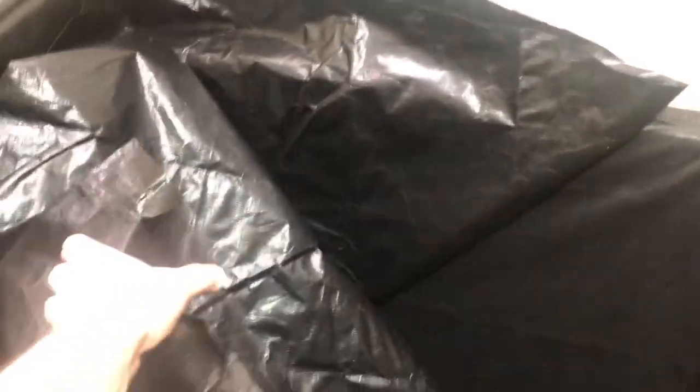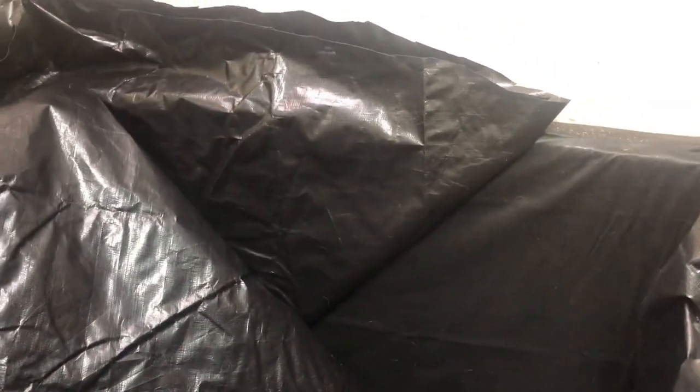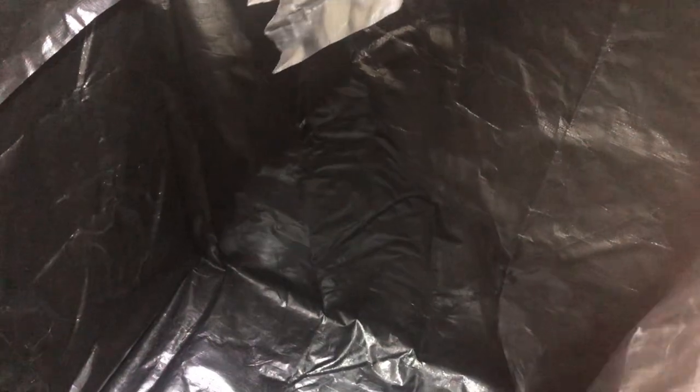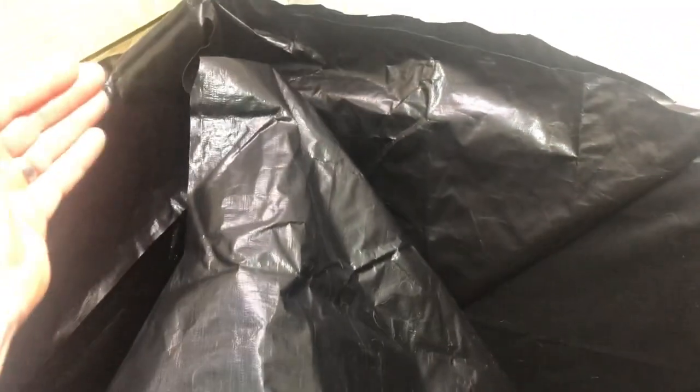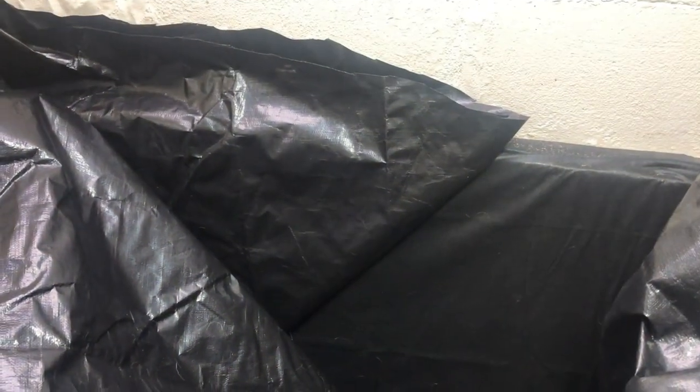So just before I move on — I've just pulled this back a bit and you can see the fold. So in theory that fold could be in the pond, but we don't want it in the pond. So it actually sits behind the liner, and the pressure of the water — roughly 1.6 tonne, so 1,600 kilos — is going to be pushing against that. To be fair, it's irrelevant because the wall will fall down before the liner does anyway. But yeah, so put your folds behind: there's the front, that's inside the pond, and the corner is folded in on itself just so it's hidden.